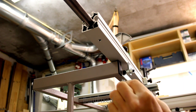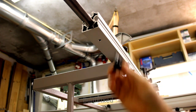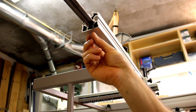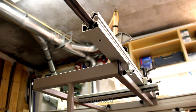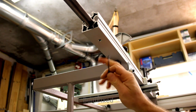For me, I found it about this far down. It worked really well to come up and tighten into the bar here. The tricky part is inside you have one of these nuts that slide down inside the aluminum extrusion track. You need to find a way to get your nut down in here, but whatever you do, don't get that nut past this hole.